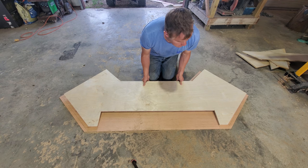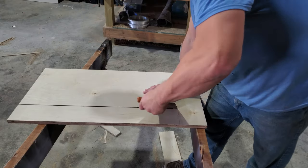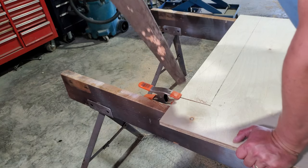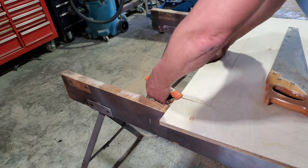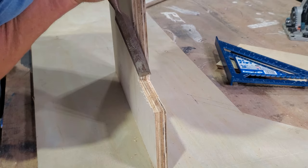That inset is like a bar-like section where people can sit. Now I'm cutting out parts of the sides of the cabinet. This edge is cut at 22 and a half degrees, so I had to do some handsaw work. And because I'm not a master of using a handsaw, I had to do a little clean-up work with the chisel.